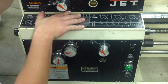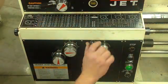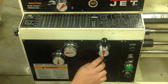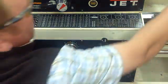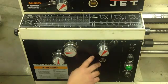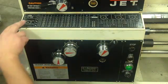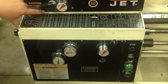Right now we're on B, so we switch to A, and down here we go to C. We've got C, D, E, F. You may have to turn some gearing to let everything slip in. So there's our C — we're going for four threads per inch, so we're at AC1.